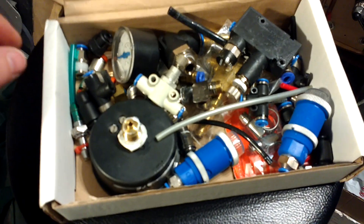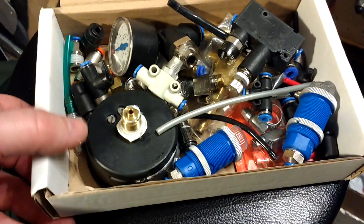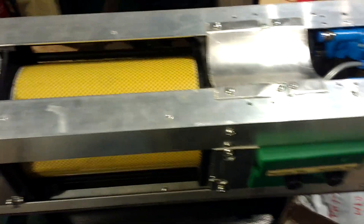None of these are rated for oxygen, but I have to admit I did use them with oxygen and I'm still here. I really can't recommend that though, because if there's any oil inside it can explode, catch fire, and then the aluminium catches fire — there's much nastiness.